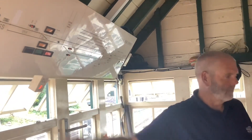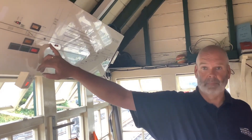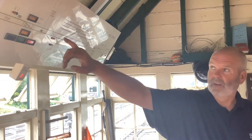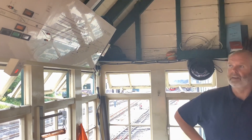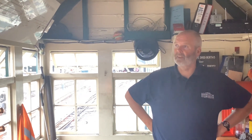It's on a timer. It also works on track circuits — if you'd have been in here as the train was leaving, it would have shown those track circuits on the way out. All the time any of those are lit, that would not become free as well. Are they reliable? Oh yeah, absolutely. The only trouble we do get is if it rains and gets very wet down there, then sometimes the electrics decide to do silly things on number six points. But besides that it's pretty good — we don't have a lot of problems.